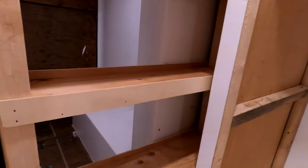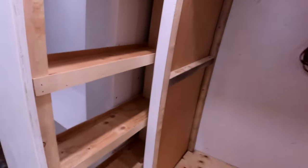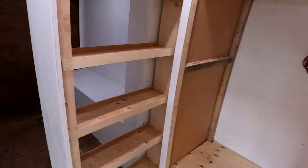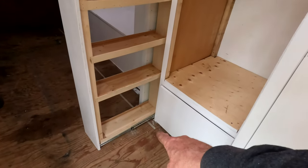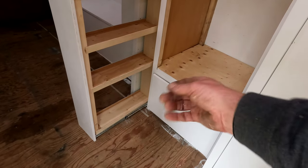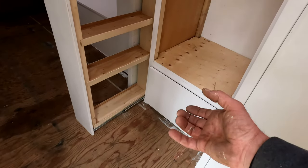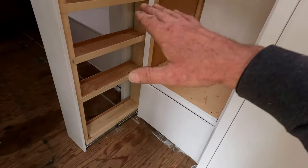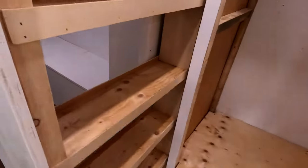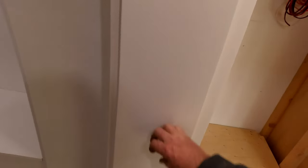I've got a roll-out designed here for the pantry-type area. Just roll it out all the way — I used some two-foot-long drawer glides. I supported the drawer glides underneath the structure with a piece of three-quarter-inch plywood to keep it up, for a little extra strength, because when it's in the trailer bouncing down the road you want to be able to support the actual unit itself.